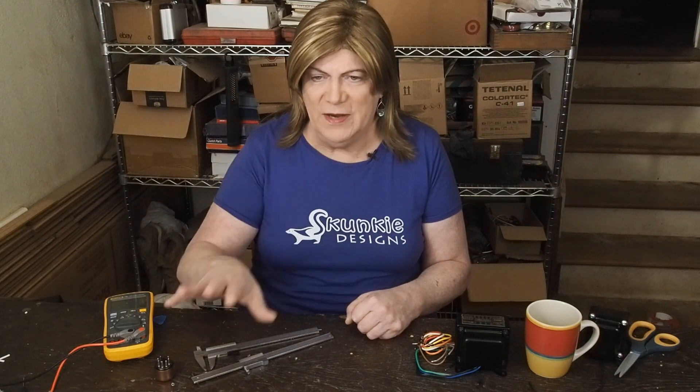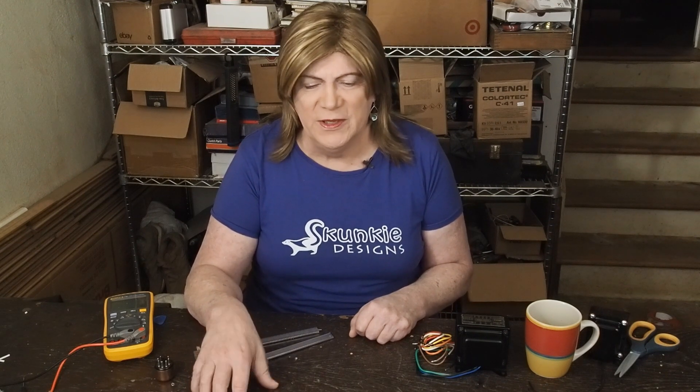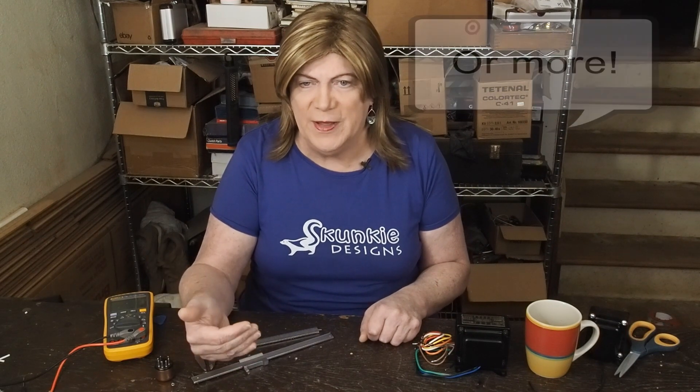The A50 modified — with the 300B-Z tubes and some nice Sylvania 6SL7s — has a clean-sounding midrange that's smooth. That's where direct heated triodes really shine. If you listen to a lot of horn music, you would probably hear a difference between the two amps, though not a lot. The bass is still thin, so you're probably going to have to buy a sub to fill it in.